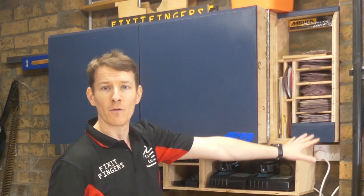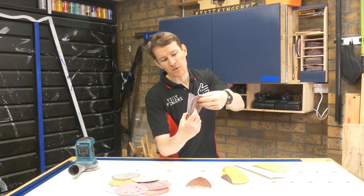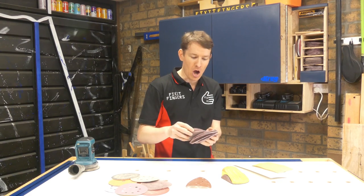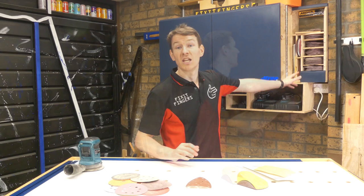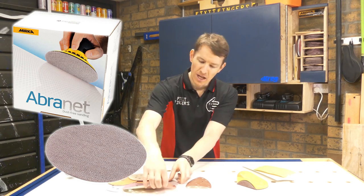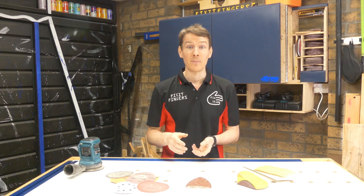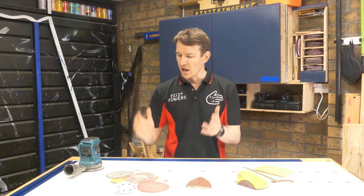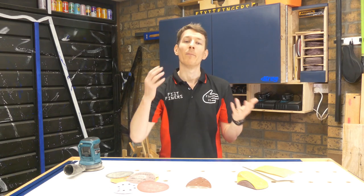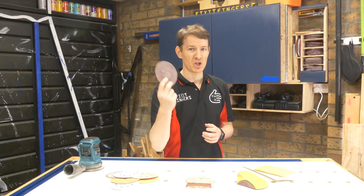This is how I like to organize my sandpaper — I've got a whole video on building a little sanding station like this. At the top I have 400, 600, 800, and 1000 grit, which are used for resin work. My favorite sandpaper is the Mirka Abranet — not the cheapest, but just like the screws, buy in bulk. The Diablo net stuff from Bunnings is pretty good but expensive because it only comes in small packets. Going to sandpaper suppliers like Hammeroo or The Sandpaper Man gives you bulk packs — buy them in groups of 50 and even premium sandpaper comes down to a much cheaper per-disc cost.